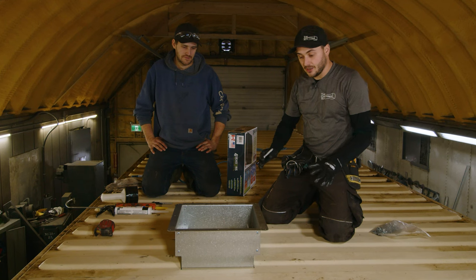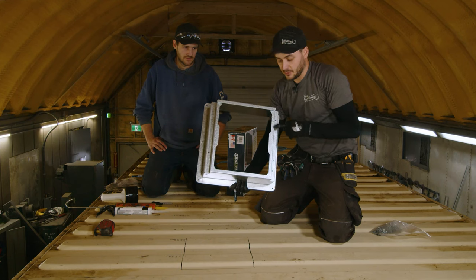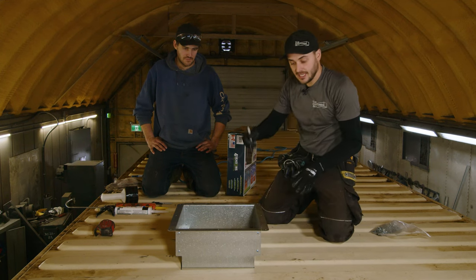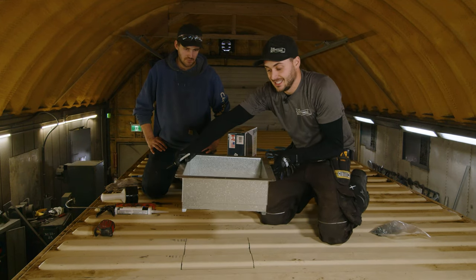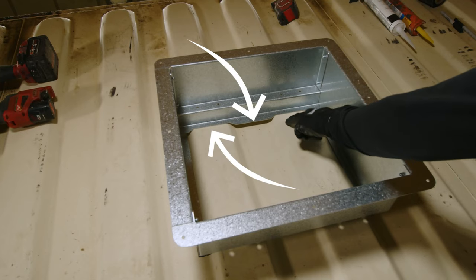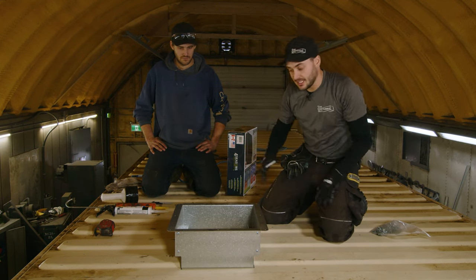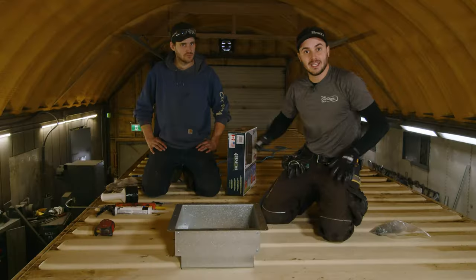William has already marked out where this vent goes. These angled profiles represent the upper corrugation on the roof. When you set this thing down, you just match those angles to the upper corrugations and you know you have it the right way. If you install it 90 degrees the wrong way, the holes that are drilled to screw into the upper corrugations will not line up. The frame itself is designed as a marking jig — just trace all the way around it and get to cutting.